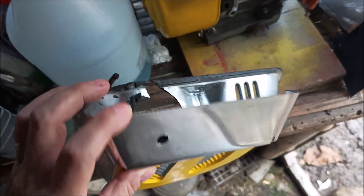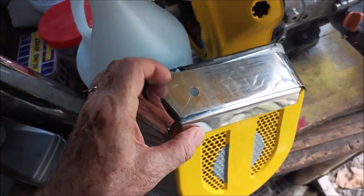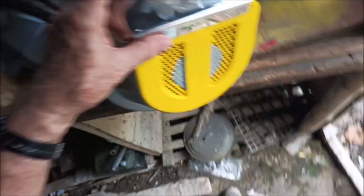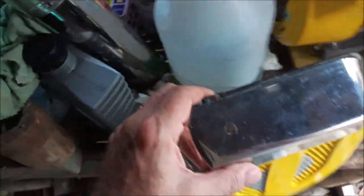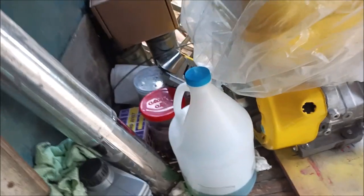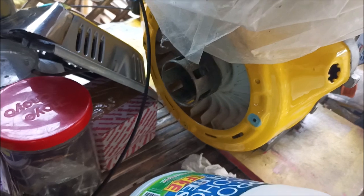It's thick enough, and I'm going to reinforce it with washers behind here. We're going to TIG weld the back of it and beef it up so it may snap but it isn't going to break easily. I've got to reshape this slightly too — bend some of the edges in a little bit so it's a nice snug fit.